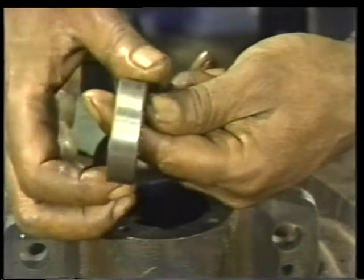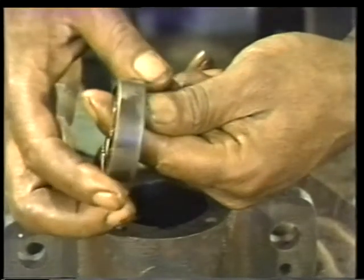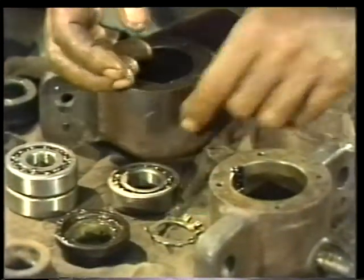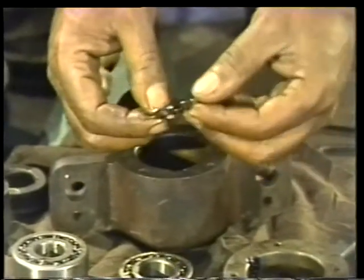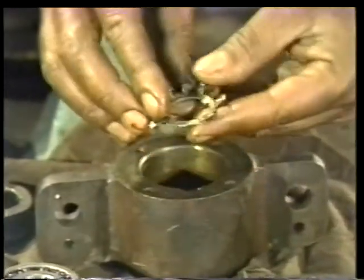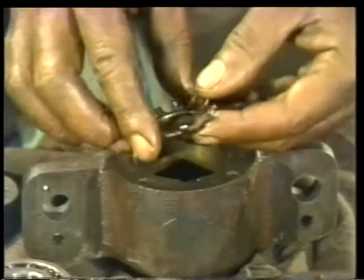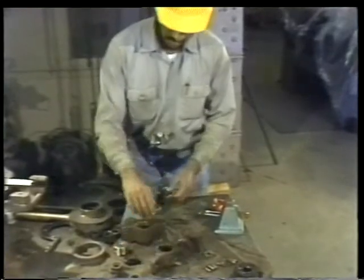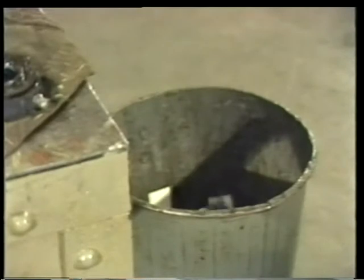This bearing is obviously warped. In addition, the outside surface shows dark spots, which are usually signs of uneven stress. This lock washer is also damaged. You can see that several teeth are missing. There's only one place for parts in this condition: the trash.